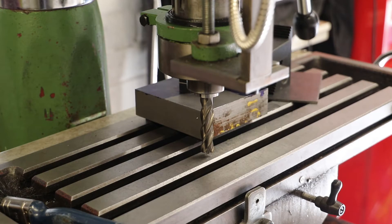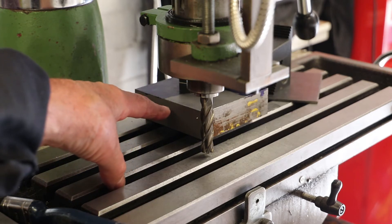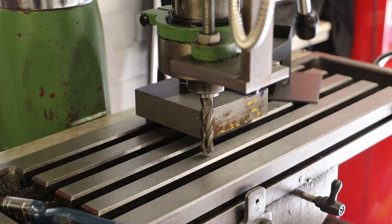For the top plate I'm going to square it off first in the mill before I start thinking about how I'm going to hold it in the four-jaw to reduce its thickness. The first cover I've done I've positioned it fairly square — I've run the dial gauge along this side, which I'm calling my reference side, and it's pretty square to the mill, but not quite perfect, and I am seeing a little bit of undulation along the surface.